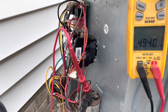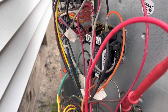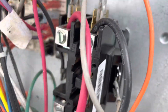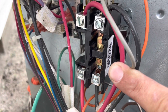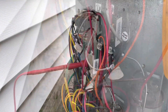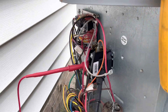We'll move on to the contactor. Even though it's new, we'll just inspect it and make sure there are no burn marks or anything. The contactor is currently pulled in, we're not seeing any signs of burning. We'll take a quick ohm reading on it: 15.2/.3 ohms, so that is acceptable.